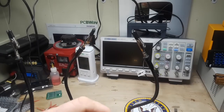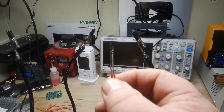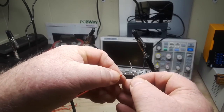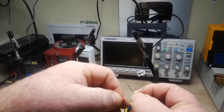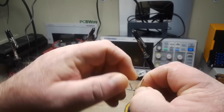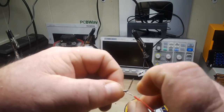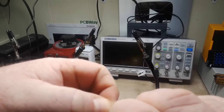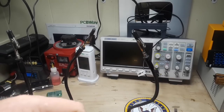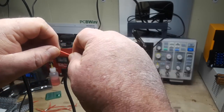Now please, for the love of God, do not just grab your wires and twist them together. Instead, take your wires, put them about halfway together in the form of a cross, and then pinch them. Then take the left-hand wire and start rolling it back over the other one, then do it with the right-hand wire. If you've done this right you should get a nice, neat little splice.